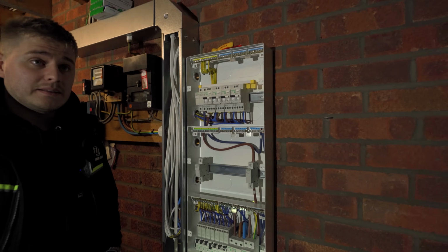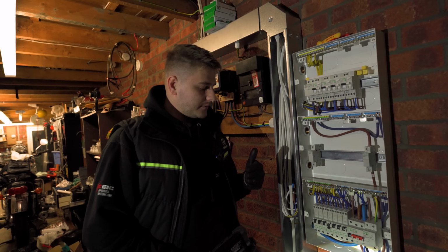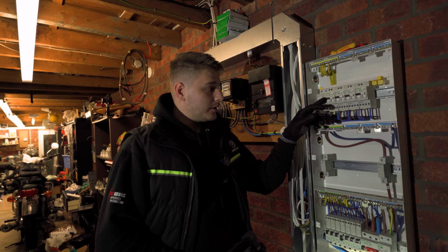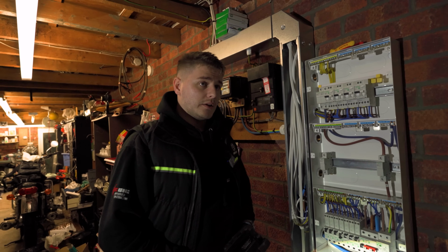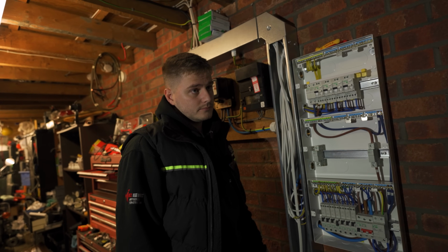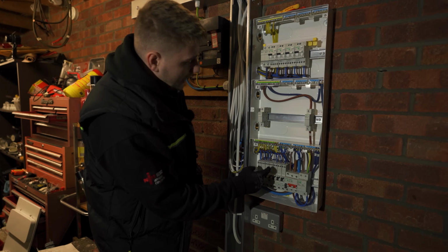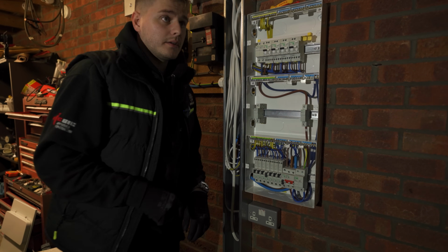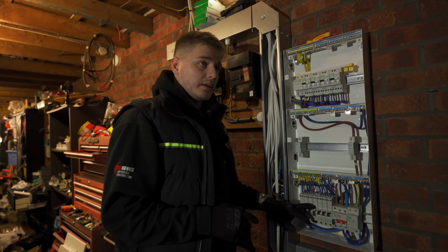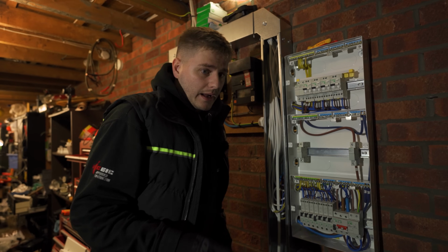Oh, it's the boiler and it's not working. No, boiler's off. Brilliant. It's all on in the airing cupboard. Okay, and then when I flick it on, it trips that. So I think you've linked your boiler. Do you know where that may be? I know at some stage I had to get a permanent from somewhere to the boiler. We're gonna have to Wago it and send it up through the AFDD for now, and then I will make that a dedicated boiler heating circuit and we'll work that out. So let's sort that out.